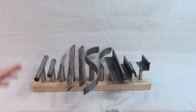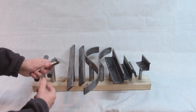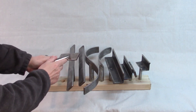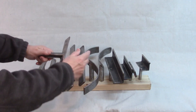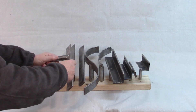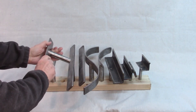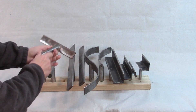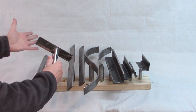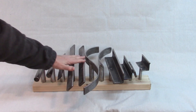After that, I went to make some tool rests like this — an inclined bar tool rest, different sizes as you can see. This one is quite simple. You take your tool post and cut it at about 45 degrees. Then you hold these two pieces together — I just pushed them together inside a little kiln I made out of bricks — and silver brazed them together that way. It's workable, certainly workable, though it's not the easiest way simply because it's hard to hold these pieces together. But as you can see, it wasn't that hard because I made three of them.